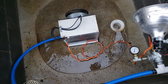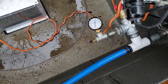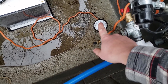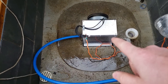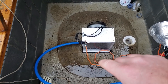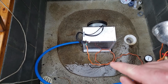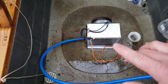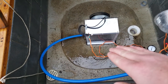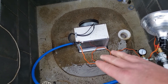Now we can see how many watts it's producing. This is a little fuzzy from condensation, but we're at about 118 PSI and approximately 11 gallons per minute. I wasn't clear in the last video — that nozzle I put on there, I ran it through a calculator and it should be outputting 11 gallons per minute, but I haven't verified. I kind of don't want to touch it right now because I have really good jet alignment and I don't want to mess that up.